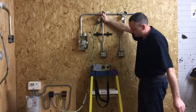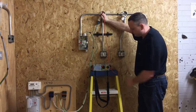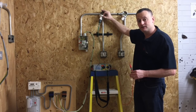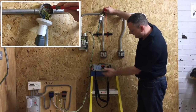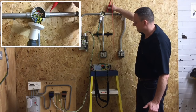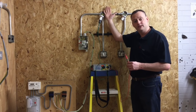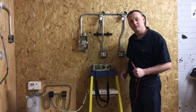Operating the switch - it goes off. Operate the switch - it comes back on. Operate the first switch again, operate the second switch - comes on and off. So we've proved polarity at this point. I also want to prove that not only does the plastic light fitting get the connection to the CPC, but the back of the box and the conduit itself. Probing into the back of the box I have a reading of 0.1 ohms, and probing onto the conduit itself - 0.12 of an ohm. So I've proved the CPC gets to the fitting, the back box and the conduit at this lighting point.